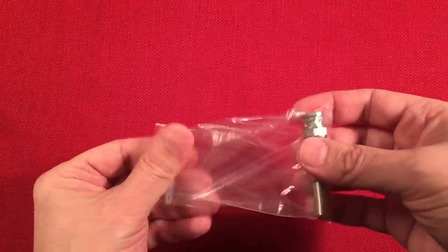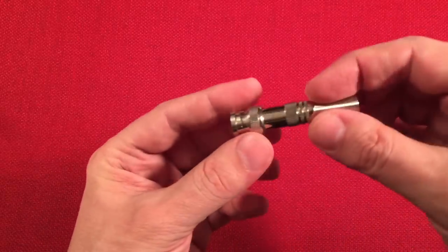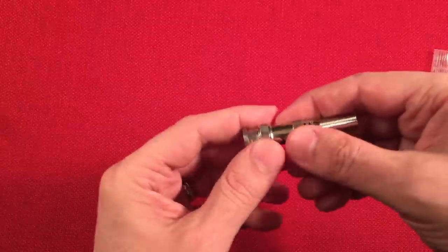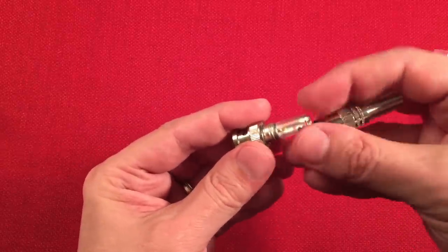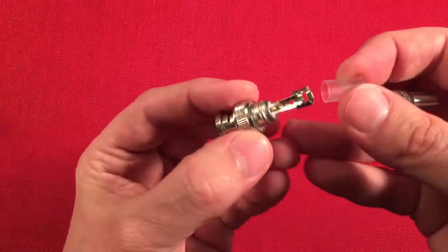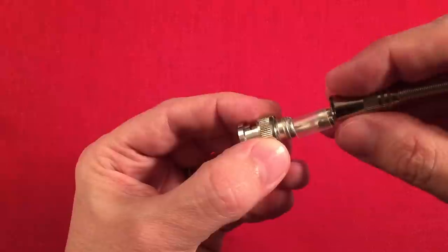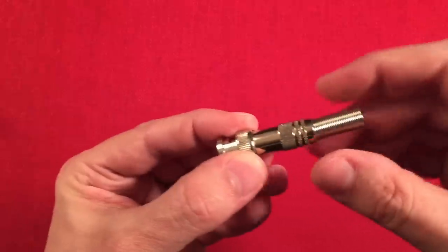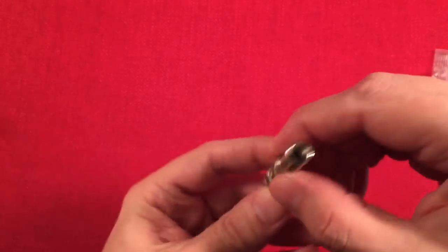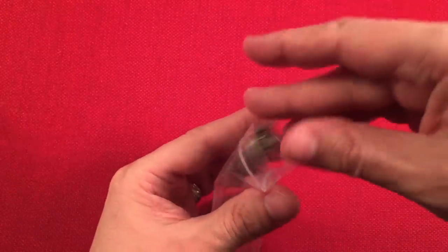We get this really cool adapter. On the back of the radio, it has a BNC. And this is an adapter they give you to build your input jack. So you can unscrew this. And then there's your terminals you can solder to or crimp. I think you'd solder to those. Heat shrink tubing. You can hook up your external antenna to the BNC. That's really nice, and it's got this little strain relief here for the input coax or whatever wire you use. Nice, nice little thing they added. You don't have to run out and buy one.